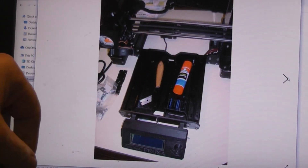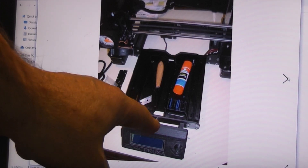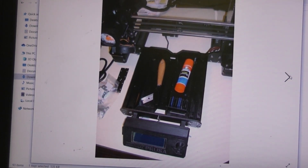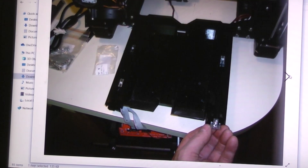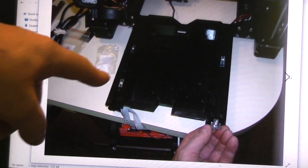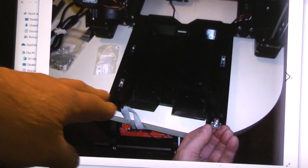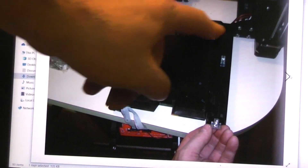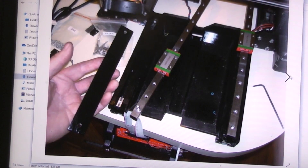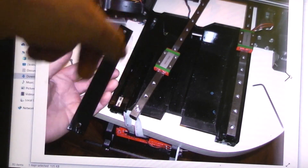I left my trays in — there was no reason to take them out. The next step was to pull the bolts and let the front drop down. I'd already unscrewed the two screws for the idler so I could lift the whole aluminum bed unit support frame away. This shows sliding in the T-nuts — at the same time I ordered the linear rails off eBay, I ordered these T-nuts to slide into the rod to hold them in. I'm just going to lay the linear rails right on top; they'll pass through these areas back here.